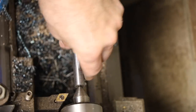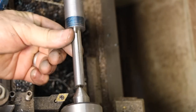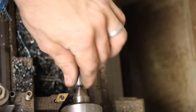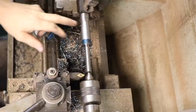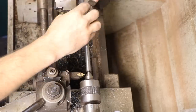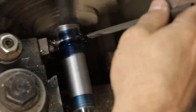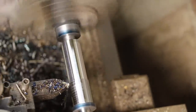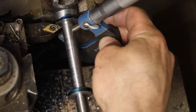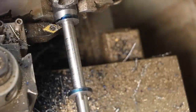I'm going to the ten-thousandths now. I have to say, this is a cheapo Grizzly lathe, but I'm able to nail this to whatever ten-thousandth of an inch I want — it's hard to complain. Now I need to machine this part to about 510 — it doesn't need to be as precise. This side's going in the wood and it's going to be held with a set screw, so it doesn't really matter that much. I'm 510 to 511 on that, which is fine.